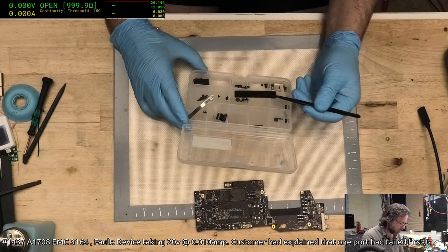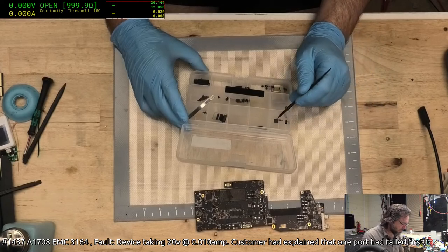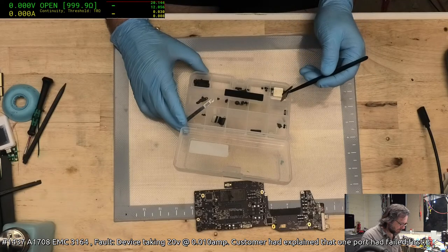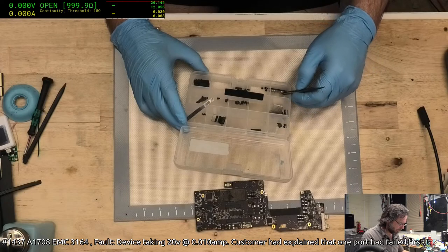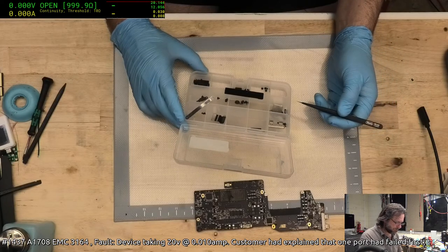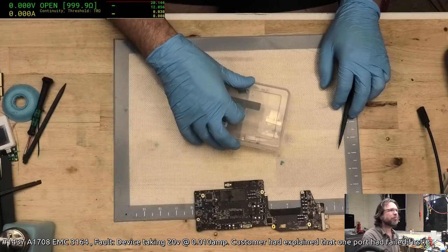Yeah, I'm not sure. I wonder if it's possible for the CD3215s to get up to 20 volts, you know, that sequence of power, and then it still doesn't get communicated that they have 20 volts on hand. I even changed the actual USB ports. Yeah, it's got me stumped for the moment.